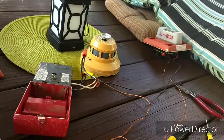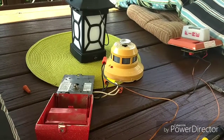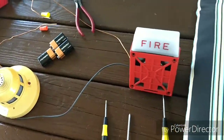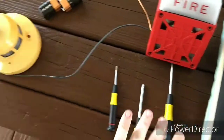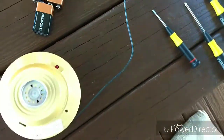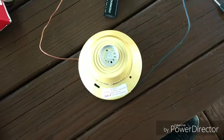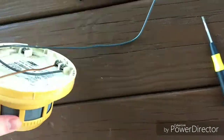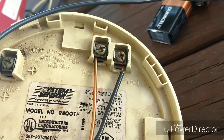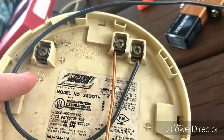I'm probably going to grab my 7000 2T. I've now switched out both alarms — I have my Wheelock 7000 2T and one of my System Sensor 2400TH units. I'm going to demonstrate how to test a smoke detector. If you turn the 2400TH around you can see there are three terminals: the first two are for the smoke detector itself, and the third is if you want to add an end-of-line resistor to it.